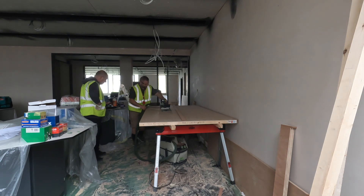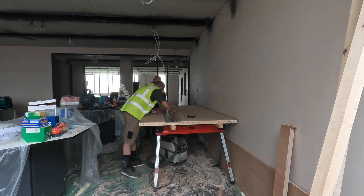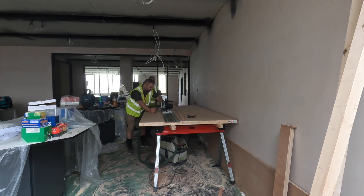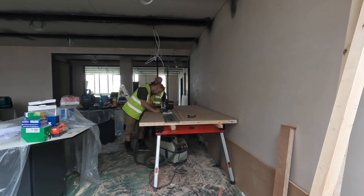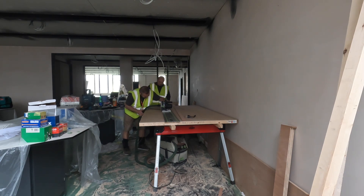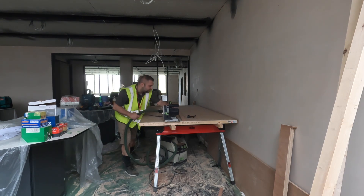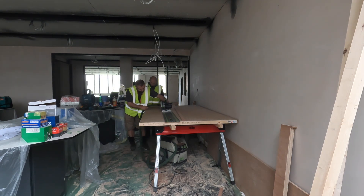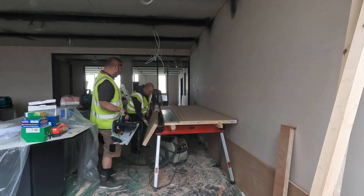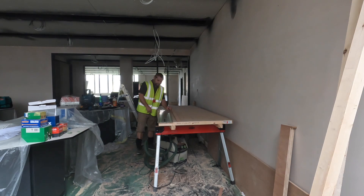Here you can see me cutting the door down to the required size. Because I was lazy and hadn't brought my long rail from home, I'm just going to use the single rail and move it, being very careful to make sure it will be a nice straight cut. Going back to the gaps — the fire inspector will check the gaps, and if the gaps are either smaller than 2mm or bigger than 4mm, the doors will not pass inspection.